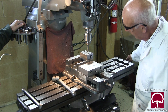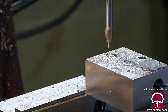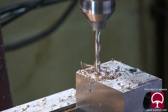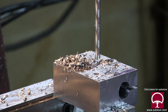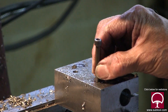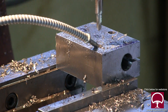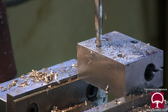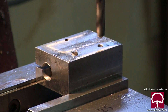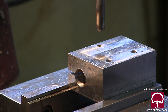Now we've got to drill a couple more holes. We center-drilled about here and moved over about there to put another one — these are clearance holes to mount the block on the tailstock. We're drilling those again — clearance for quarter-twenty. Now we're going to counterbore it. That's a pretty good shot of the counterbore there. That will make sure the cap screw doesn't protrude above the surface. Here we're chamfering it — just came in and said about here, about there, right about there, so we'll chamfer that.